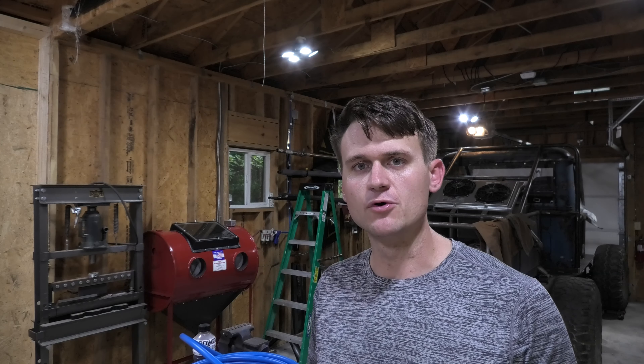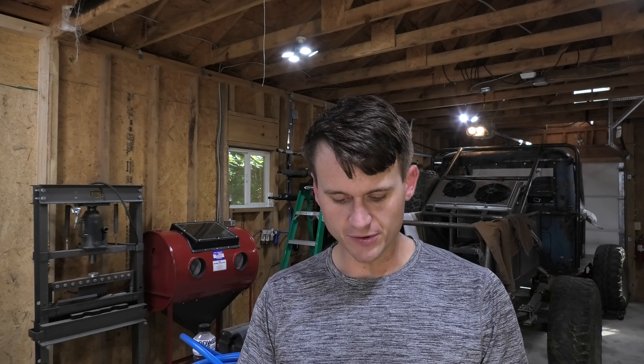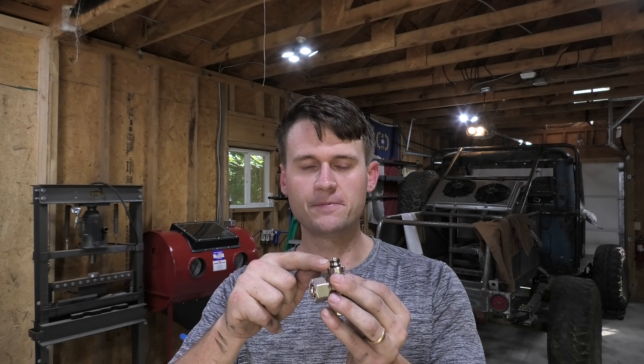I just did the first little run from those filters up to the top of the shop where the line's going to run around. My first impression is that this tubing is way better than the stuff I used to have. It is twice the cost, but the tubing itself is more rigid — you can feel it's stronger and it bends without wanting to spring out; it holds one shape. Their T-fitting works by having two O-rings and a male nipple inside the hose, and then a collared sleeve and nut that pinches the whole thing together. When you tighten it down, the collar tightens around the tube, pinching it onto those O-rings — a really good design, and I'm confident it'll result in far fewer leaks than my last air system.